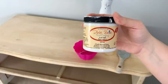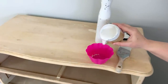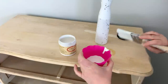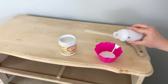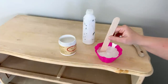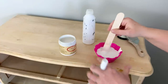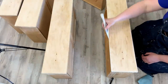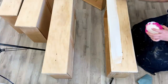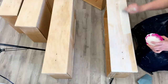I've decided to do a paint stain on this dresser and I'm using Dixie Belle's Fluff — hands down my favorite white paint to use. You get excellent coverage with it, and while white is usually a tricky color to work with, Fluff makes it a lot easier. My ratio for this wash is one part Fluff and two parts water. I want this wash to be very, very thin because I don't want to cover the dresser in white paint — I just want it to be very subtle, look very natural, still look like wood, still see the natural color, and just cover some of the unevenness in the tones. I apply my wash with a brush going back and forth, and because it's so watered down I get a little more work time.